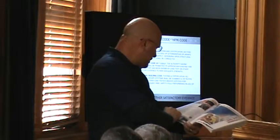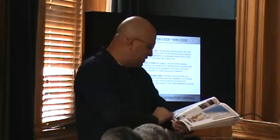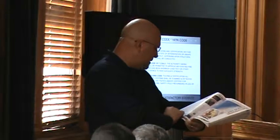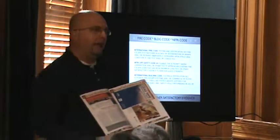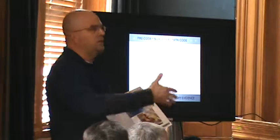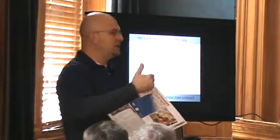Shall be examined or tested and certified for structural adequacy and safety every five years by a Mass-registered professional engineer, or others qualified and acceptable to the building official, who shall then submit an affidavit to the building official. The affidavit has been in the past a letter on their letterhead, a document that basically attests to the best of my information and knowledge that components conform to the Mass Building Code — but that's all it says.